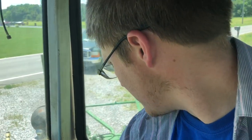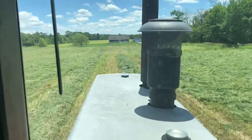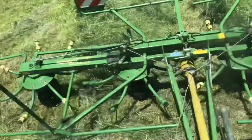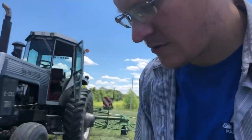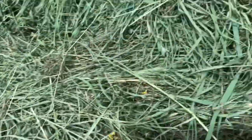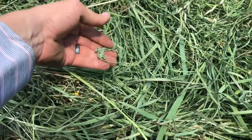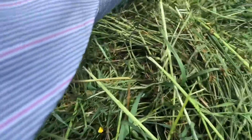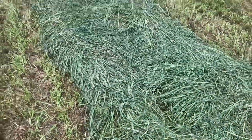Tedder down — we've got a rope here with locks on it. Let's take a look at this real quick. The un-tedded — you can see the grass is dry on top, some of the leaves on the alfalfa are a little bit crispy right now. But you get down in here, flip this over, and you see it's green as can be. This field here is actually drying way better than the other field. This one didn't have as much moisture in the ground — it wasn't as thick, it wasn't as heavy, a little bit more mature. So this is going to be drier quicker.